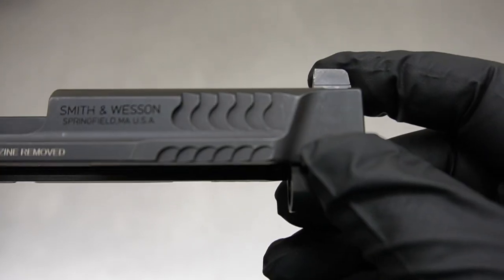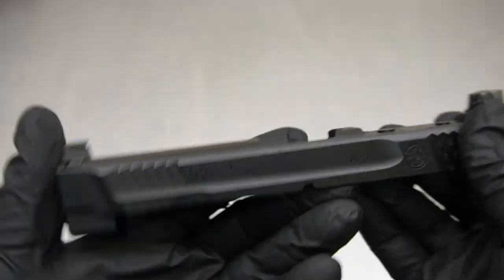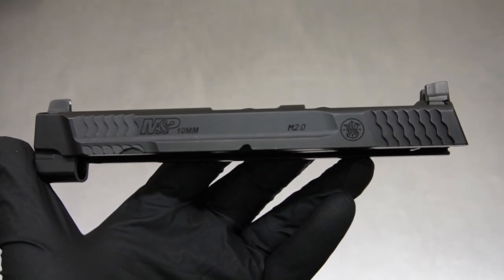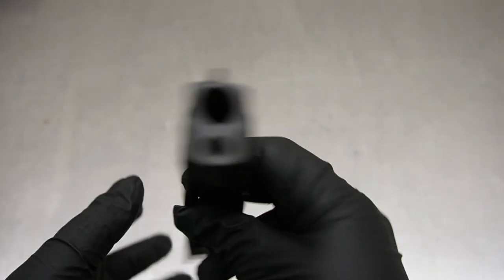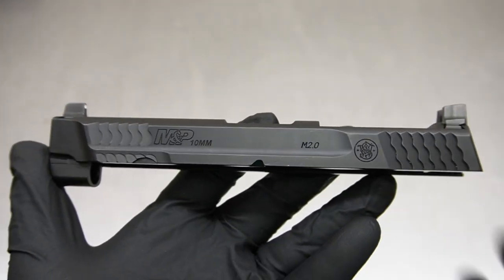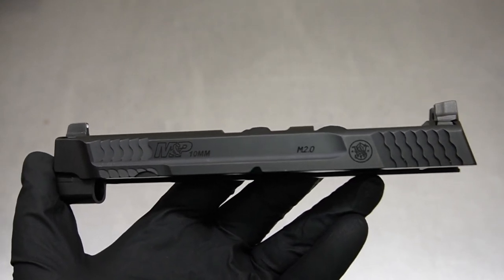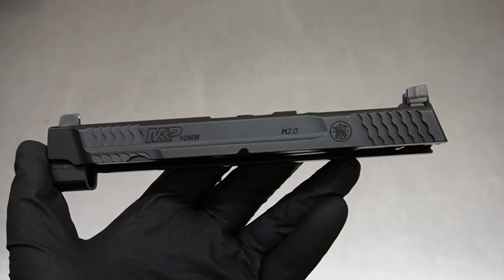You can see it here and right there. The point I'm making is that if we decide to go with a side window, it's not always easy to just shave the side — sometimes we're working around flaws from the manufacturer. Sometimes there are differences in engraving depth and they're not in the same location on some pistols. So if we do decide to shave the side of the slide down, we're going to do our best to make it align and look correct on both sides.